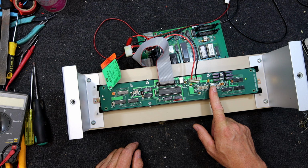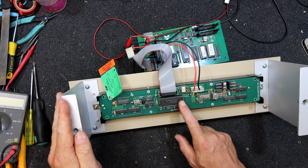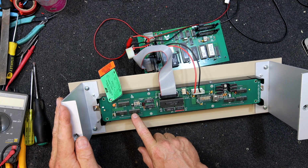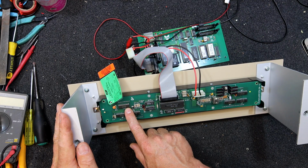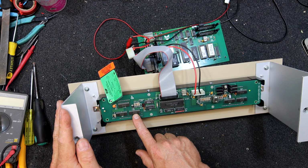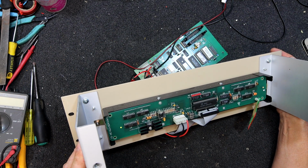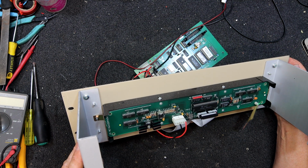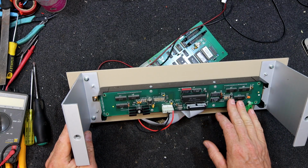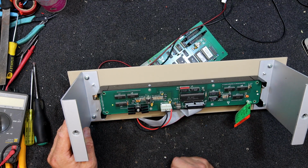That is probably an inverter to run the relatively high voltage. I've got a big NEC chip in it. So that's probably a bulletproof thing like these other buffer ICs or something. I think it's UCN 5810. What are they? Might help to read it the right way up. UCN 5810AF, I think. Yeah, 5810. So six of those. There's some other 74LS10, 74LS00, 165, 00 again.